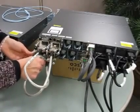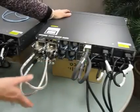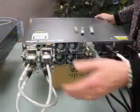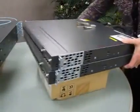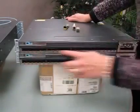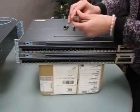At this point, your switch stack is actually together. You've got your power supplies installed with power cables ready to go, your power stack failover cables are in place, and your switch stack is pulled together. We've also put on the rack mount kits. Now that our switch stack has been constructed, let's put in our transceiver interfaces ready to go for connection to the existing fiber that goes out to the closets or uplinks to WAN circuits. Because these 3750 models have just slots, they take small form factor transceivers — SFPs — capable of either single-mode fiber, multi-mode fiber, or RJ45.